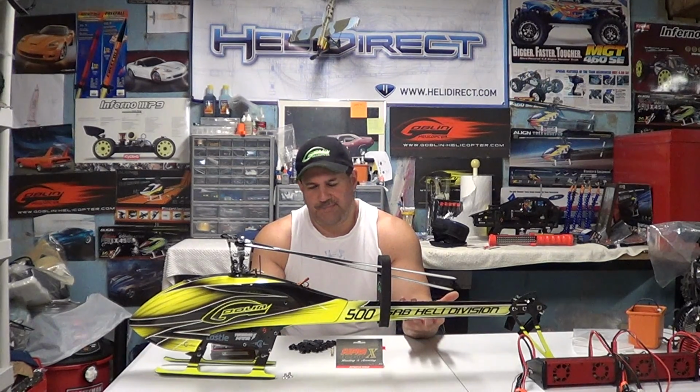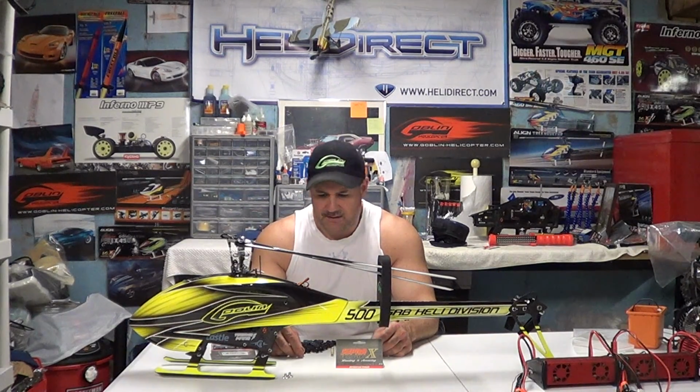And these have a peak current of 230, a continuing current of 190, and the applicable wire is 8 to 10 AWG gauge, 24 karat gold plating. Now I bought the biggest ones because the wires are all pretty big on these. The Castle 160 is about as big as you're going to find for wires, so these definitely make life a lot easier. If you don't want to use these bigger ones, they have a lot of other different sizes, like 450 size and that, but these were really nice to solder, guys.